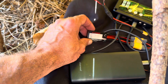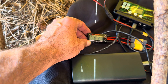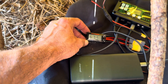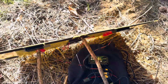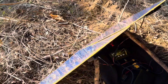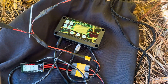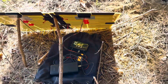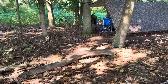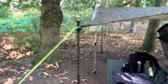Five watts is not really going to cut it for a 70 watt-hour battery. Even at 10 watts, that would take seven hours to fill 70 watt-hours. With maybe three hours of sun left, I can't see it happening. Even though this is a 40-watt system with good quality panels, and the charge controller has tested at 15 watts in lab conditions, you have to be realistic about what you expect from solar energy when skies aren't perfect, alignment isn't ideal, and panels are running hot.